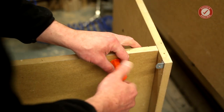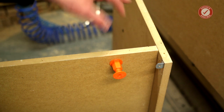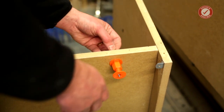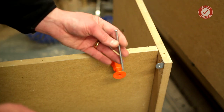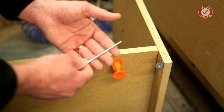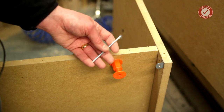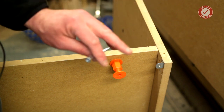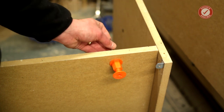Pop that back. If it's in a hard-to-reach place where you can't physically hold it, you can pre-mount them, pop your screw through into the wall. By the way, I'm using four inch 10-gauge screws here. I tend to use 10-gauge screws for just about everything — they're a good balance between not being ridiculously big and work well in red and brown plugs. I saw someone complaining on a review on Screwfix or Amazon saying they couldn't get screws long enough — ironically on Screwfix, who sell every type of screw you can possibly imagine. So I don't see why you'd ever run into a problem.